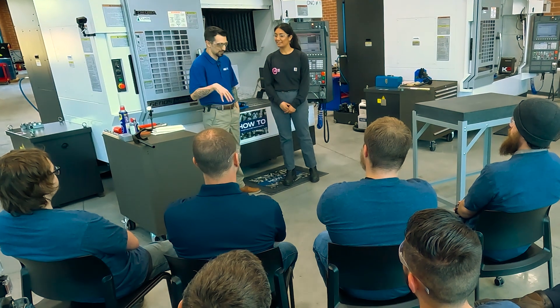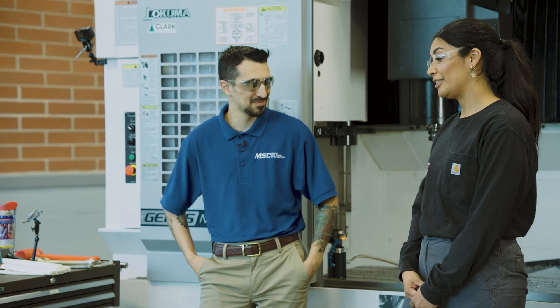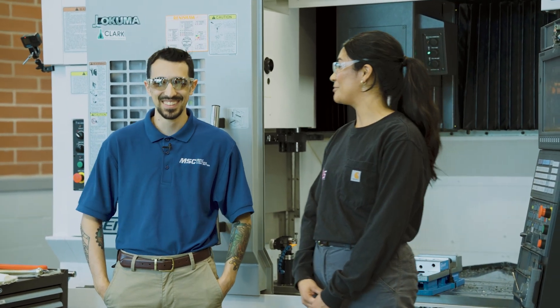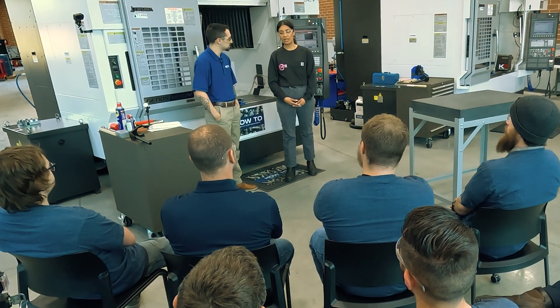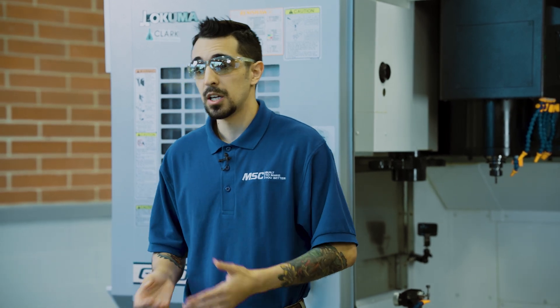How upset was your dad, the fact that he was a fab guy and you said, you know what, I want to put in CNCs instead? I mean, he loves it because we work together and I do all of the work for him almost for free, but we hang out every day. Now, if you're working on a brand new, never before used mill, it comes with all this oil from the factory and you're going to want to get all of that off before you try to do any type of setup. When you have a machine that's already been used, you're going to want to use coolant or an air gun to get all those chips off.